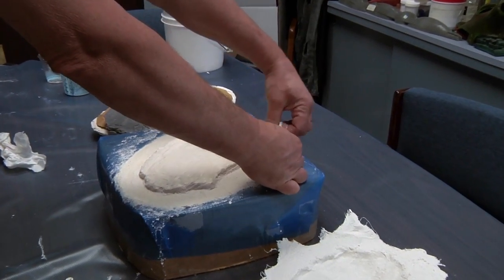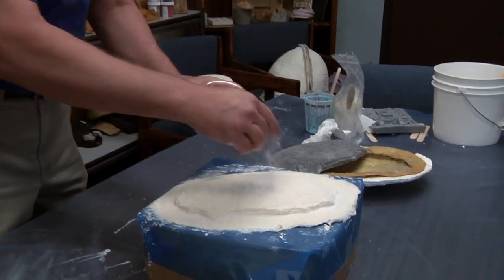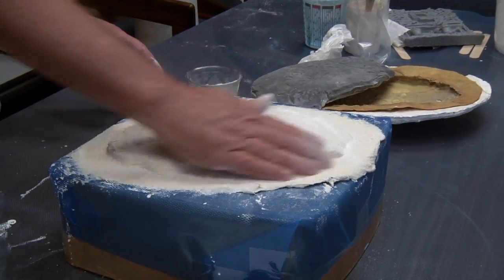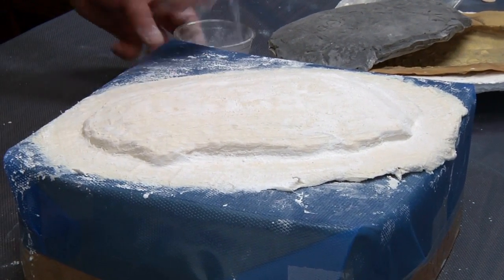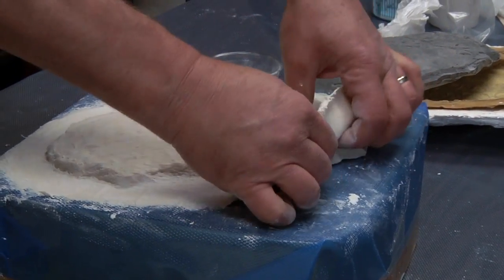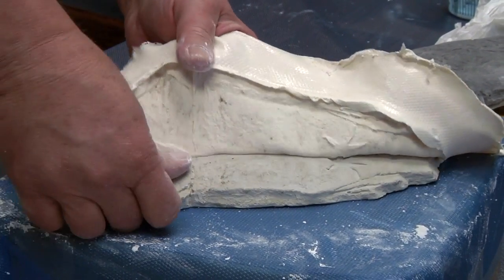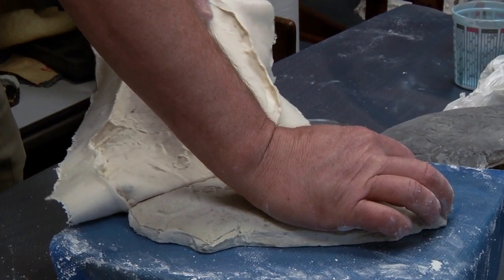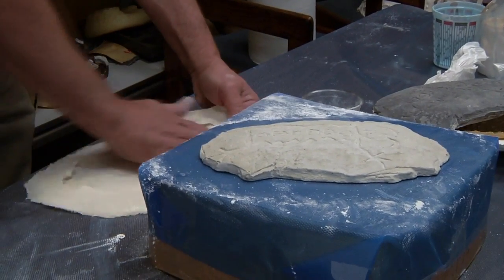You will see that we got a little bit of the rubber sticking back to itself, so I'm powdering it with a little calcium carbonate — our CC 200. Talcum powder can also be used. This will keep the freshly dried latex rubber from sticking to itself. Start pulling it up gently from the edges outward, being careful not to rip the freshly made rubber mold, especially if you used less than 15 coats. Dust the inside of the mold, shake it off into the trash, and now you have a mold.